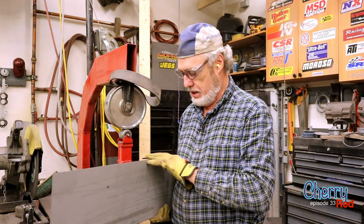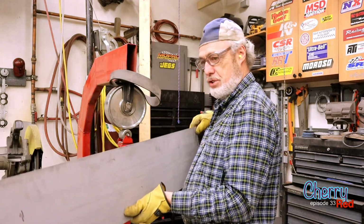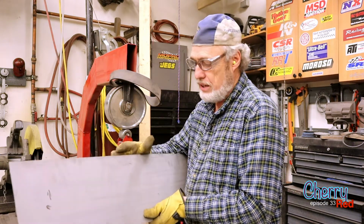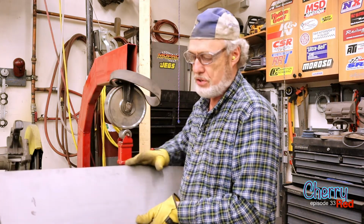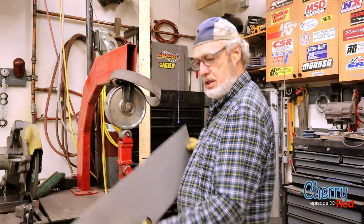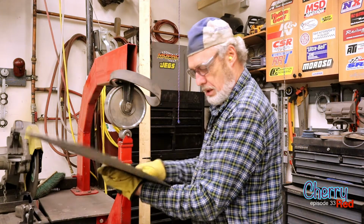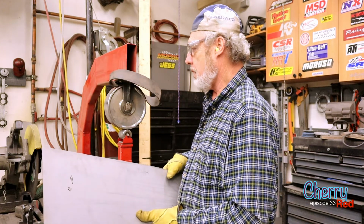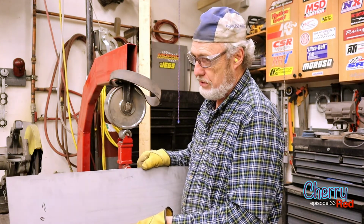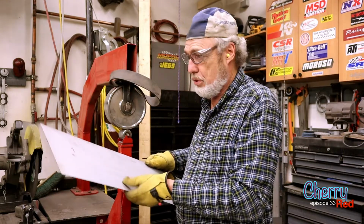Now we'll take the cut side. That's this side. This is actually the end of a new sheet, which gives you a perfectly straight line, which is going to go into the V and make the weld. Just helps to have that really straight. Now this one here, I mean, seriously, I did a nice job cutting it, I'll tell you. It's pretty hard to find any flaws in that. But anyway, this one is perfect. So this is where I'm going to put the little V-bend in here. And then we'll put the fold on this side to go around the door part.